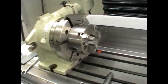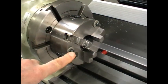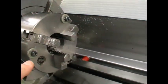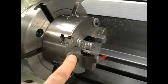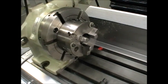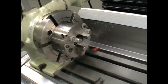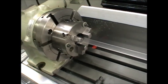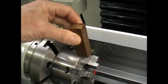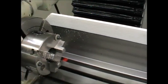For this job I've mounted a smaller chuck and used what I call floating cap screws — cap screws screwed through to T-nuts which have clearance on them. You can hold a piece of ground diameter in the chuck and tap it until it's running perfectly true, giving you a very accurate way of holding your part repeatedly. A small chuck also gives you more clearance in the spindle area, which is why I used it in this case.